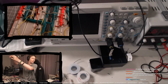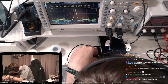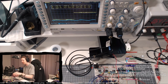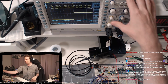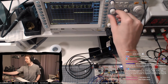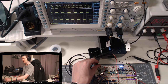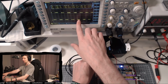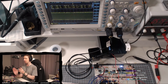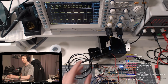Let me turn on the oscilloscope. I guess we can plug it in here. That's the clock. There we go. We disable channel 2, the blue one. We don't need the blue one right now. So this is the clock. Let's scale it a bit differently. Now let's turn up the hertz. You will see that these pulses will get now narrower. Now they are very narrow. So I'm zooming in now a bit more so we can see it better. Let's turn up a bit more.